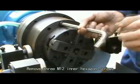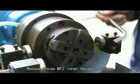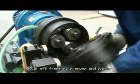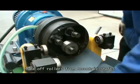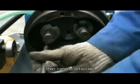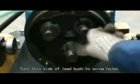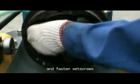Remove 3 M12 inner hexagon screws. Take off the front axle cover and cutter. Take off the rollers from the eccentric shafts. Then remove the set screws. Tension the side of the lead bush to the screw holes and fasten the set screws.